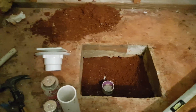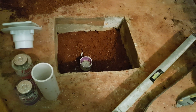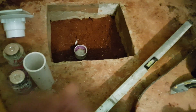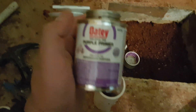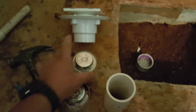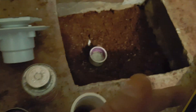Let's start by understanding the drain we're going to use. You can find them as round or linear drains, but this one has three components: the top, the flange on the bottom, and the base. You want to make sure the base is flush or a little deeper than the surface. This concrete slab is uneven, so make sure it's a little bit deeper. We want to make sure it's covered and prepared really well, and from that point you create your pre-slope.